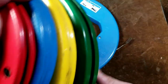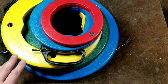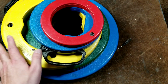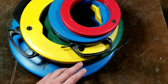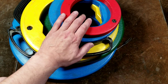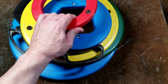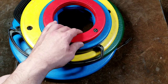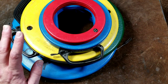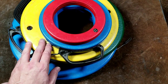That about finishes up our talk about fish tape and the various brands and styles. Generally you don't buy a 200-foot tape right off the bat because of the size and weight — that's why 50-foot tapes are so common, as they fit most fishing needs without a lot of extra bulk. Thanks for watching and subscribing. If you haven't subscribed, please do. Caddis Maximus out.